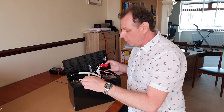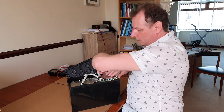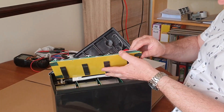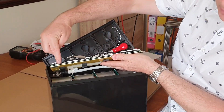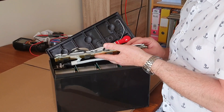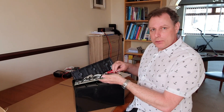Let's see if I can lift the battery management board out a little bit. Here we go — there's some industrial plastic film screwed to the bottom of the battery management board. There's a whole bank of MOSFETs there; this is where we get our 160 amp continuous rating from. Perhaps we can dismantle the BMS at a later date, because it's quite a complex BMS, having a current shunt and the data being taken off to the Bluetooth transmitter.